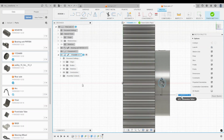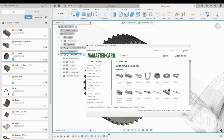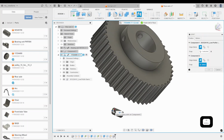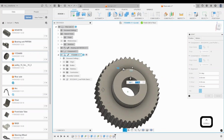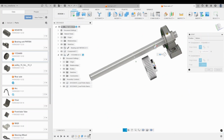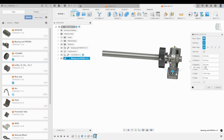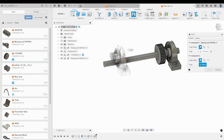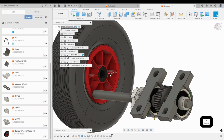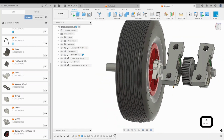This pulley is one of the parts that needs to be modified directly by the supplier or by you. First, the inner diameter must be enlarged to 20 mm, and then two holes need to be drilled and threaded so the pulley can be secured to the shaft with grub screws. If you order this part, you can simply add a note with the modification you need, or even attach the technical drawing that shows exactly how it should be adjusted. The drawing is available for free in the Google Drive mentioned earlier. The link is in the description. The name of the drawing in the folder is pulley44t.pdf. There is also a DWG version if necessary.